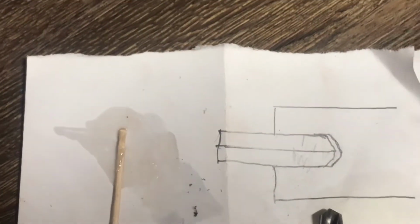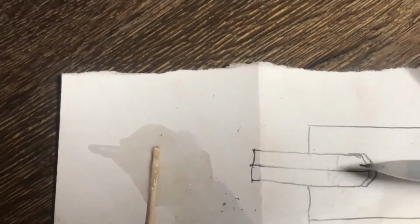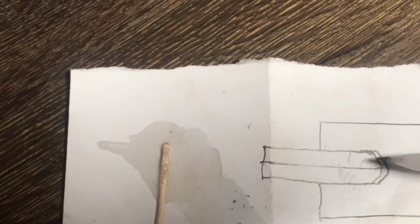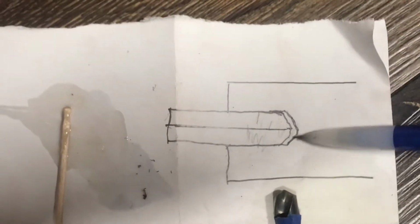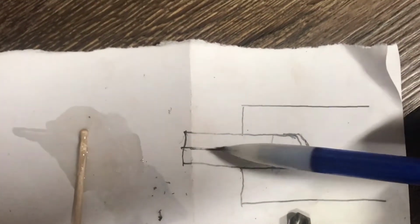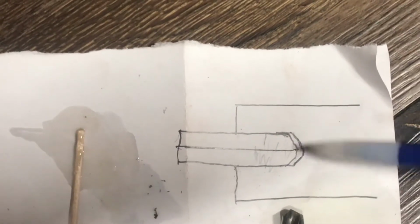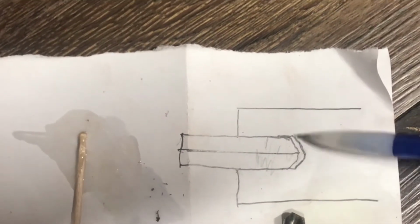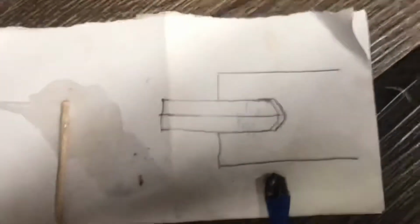And also, if you don't drill this air hole, what's going to happen is when you try pushing this Delrin rod tenon in, it's going to have too much air pressure in here. You're going to have a tight seal with the epoxy on both sides, and you're not going to be able to compress that air. So with this small hole, this relieves the pressure so you can get it seated all the way in. And the epoxy will fill any little voids. I mean, there shouldn't be this much of a void, but it'll fill any little voids. So just wanted to show that.